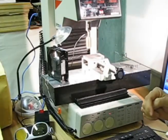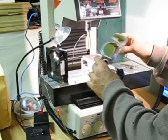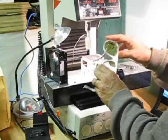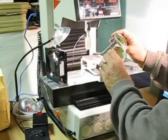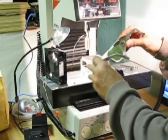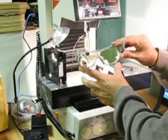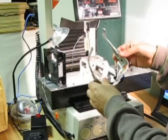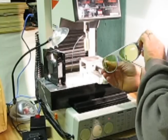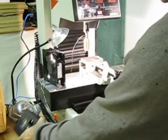One thing you always have to do when working with lasers is make sure you've got a good pair of protective eyewear. These ones are designed exactly for 808 nanometers and let most other light through. You can get less expensive ones which block more frequencies, but they're quite dark — like wearing sunglasses — whereas these are quite transparent for normal light.